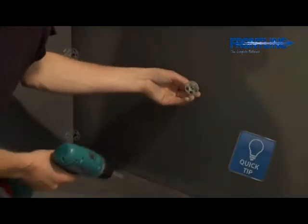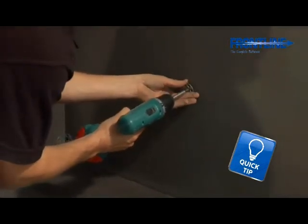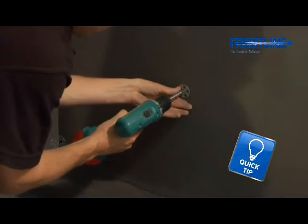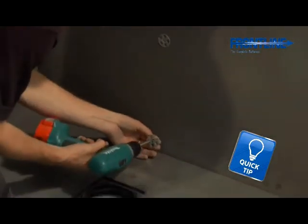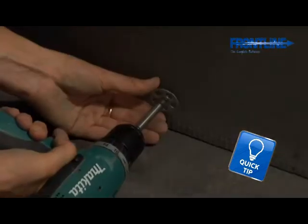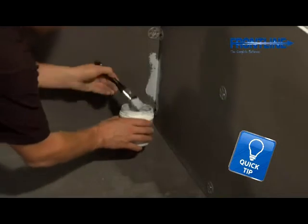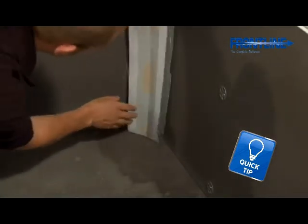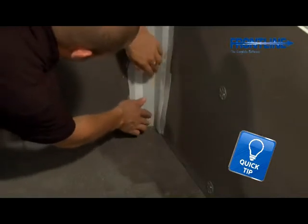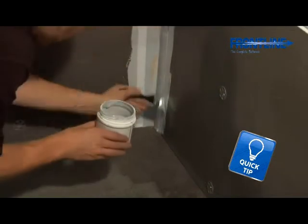Although in this wet floor installation you see the walls lined in plasterboard, which is common in the UK building industry, we would highly recommend the use of our 12mm waterproof wall panelling due to its many advantages over plasterboard. It not only gives a waterproof substrate for tiling onto, but it also gives an increased insulation value in the room, a far stronger adhesive grip to tiles, and has anti-mould properties.